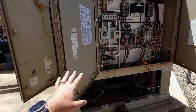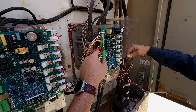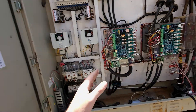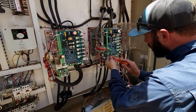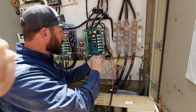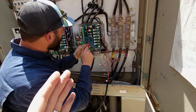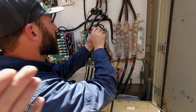Circuit one's running just fine — it's not having issues. Out of the sake of testing and troubleshooting, we did end up taking our start input and running a temporary jumper to the contact coil so that when the Microtech called for the circuit, it automatically brought a bypass starter in. The compressor does turn on and run, and we did get a 40 code — shorted or open SCR — which is honestly a good thing. It means the board can do more than just throw a 39 code. What we're curious to see is: do the alarms follow the boards? Is this one going to throw a 39 on the other one as well, or does this board register a no line inside the other chiller? I don't really recommend swapping boards like this, but when you don't have very many other options, sometimes this can be an effective way of making some kind of progress.